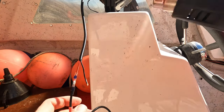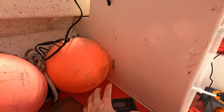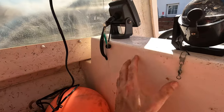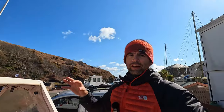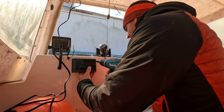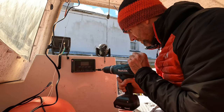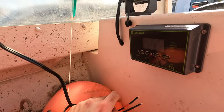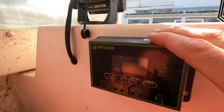That's pretty solid already - you can feel it's not going anywhere. Now while that's cooling, I'll strip the negative off. The controller has USB connections so if I ever have it here I could charge devices - they're not going to get wet. Before you drill into something like a console, make sure you check it's not going to interfere with anything on the inside. Luckily mine has access. Pre-drilled the holes. I've got my wires coming down ready to go into the controller from the solar panel. A good position for the controller, I feel.